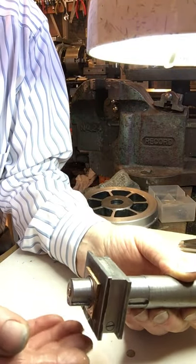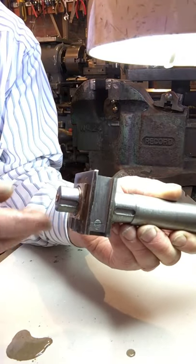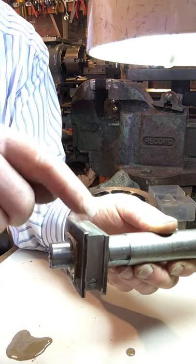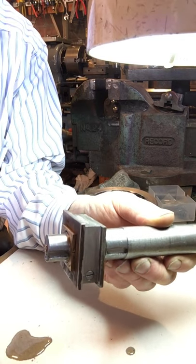The pad then puts oil on the underside of the axle, and whichever way the rotation is happening, the axle draws the oil up to the top where there is no hole, and the lubrication is perfect. So I hope that's sensible.